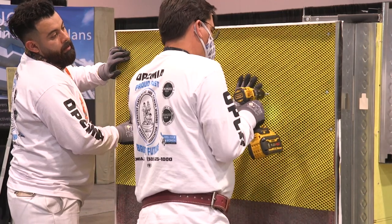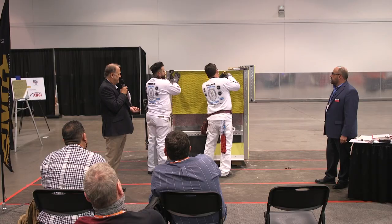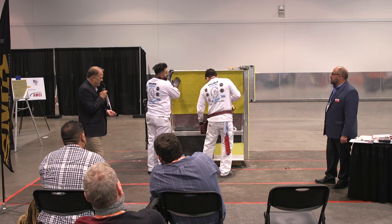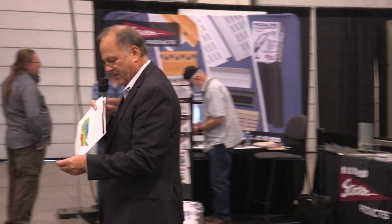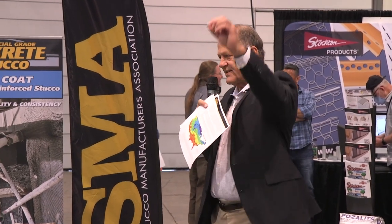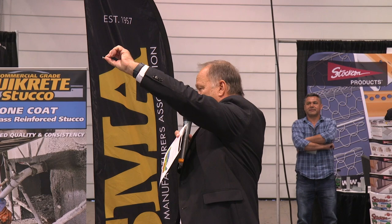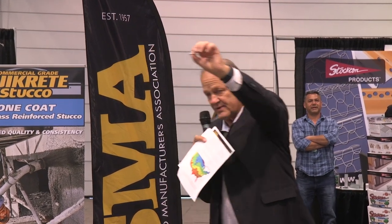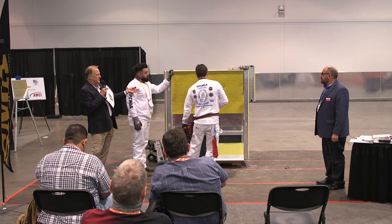The attachment is six inches on center along the stud. In this particular case, we've got steel framing, so he's using self-tapping wafer head screws. The wafer head screw — it's not just your standard screw. It has a little bit of a larger head to it, and that's so it engages the lath on three strands. You don't have to worry about doing extra furring because the furring is already built in.